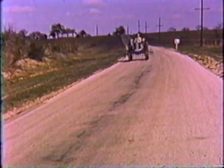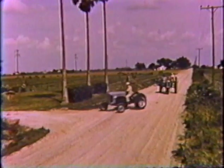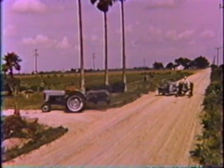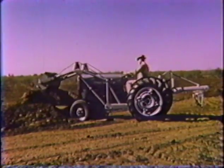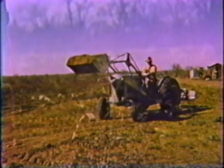The Ferguson 40's low gears are also useful for harvesting in heavy stands and for pulling tough hills. You'll also find these slow speeds useful for precision grading, spraying, transplanting, implement attachment, and other jobs requiring close, accurate tractor control. If you want fast speeds for highway travel or working with the mower or rake in smooth level fields, you shift to high range second or third gear. In the Ferguson 40 you'll find both a normal and a fast speed reverse for loading dirt and manure and other utility jobs.